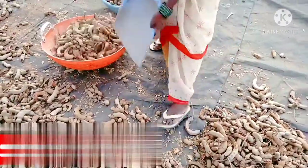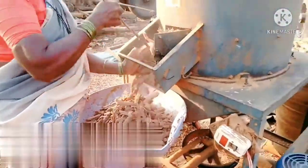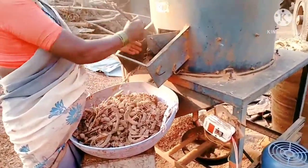Tamarind Dehuller Machine — it is useful for dehulling of freshly harvested matured dry tamarind. The dehulling unit consists of serrated mild steel rings mounted on two parallel shafts which rotate in opposite directions. Small pins welded onto the surface of the rings act as beaters to break and separate the brittle tamarind shell.